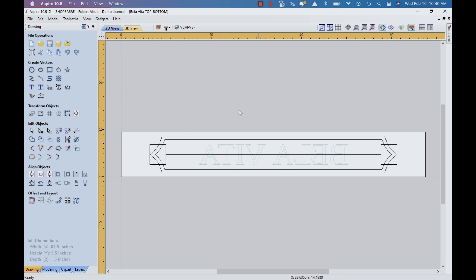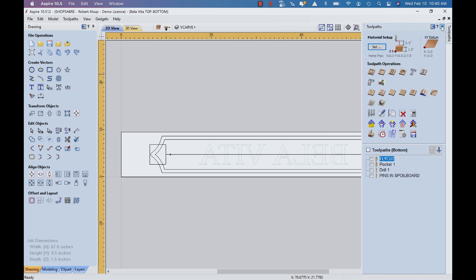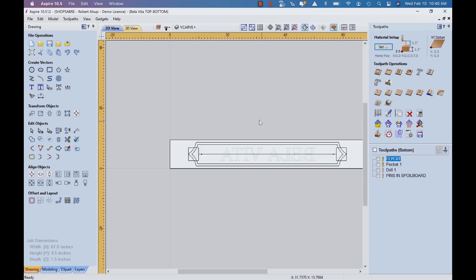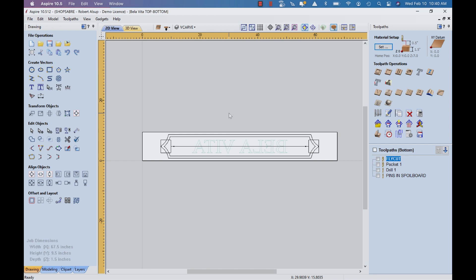On the back side, you notice there's some geometry — a rectangle and a rectangle for a pocket, and there's two holes. The first thing I'm going to do is fly cut. The reason is I want uniform thickness because we've got a lap joint in an area. If the starting thickness isn't correct, the joint won't work right. I wanted to bring the material exactly down to 1.5 inches — when miked after painting it turned out about 1.52, so first we fly cut that.